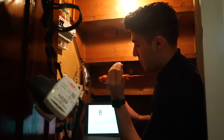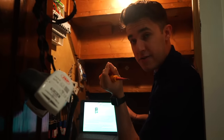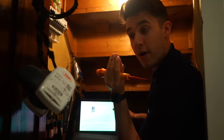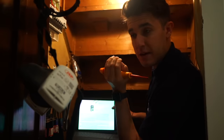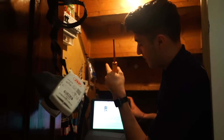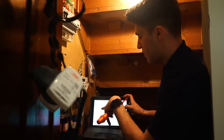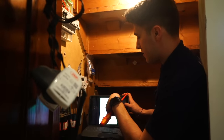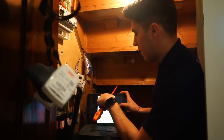So that would be my R1 plus RN. And then what I would do is I would take the highest of those values, so say 0.43, I'd times that by 1.67, and that is about the reading that I would expect to be obtaining for my end-to-end continuity on the R2 of my ring. So that, just to tell you again, is page 46, and it's section 2. And if you want to know about ring continuity testing, this is Guidance Note 3.